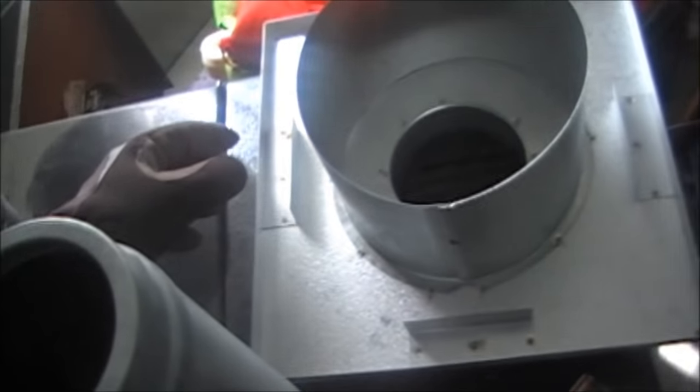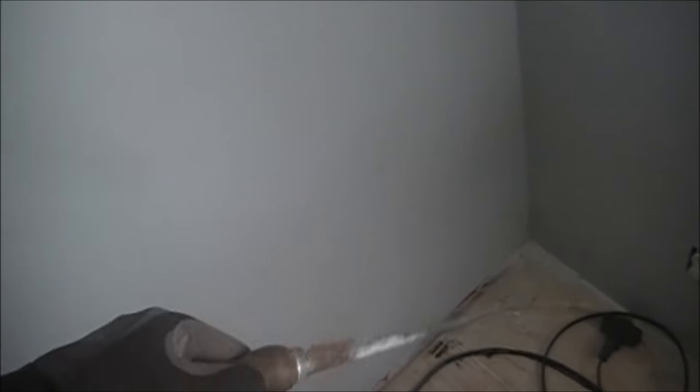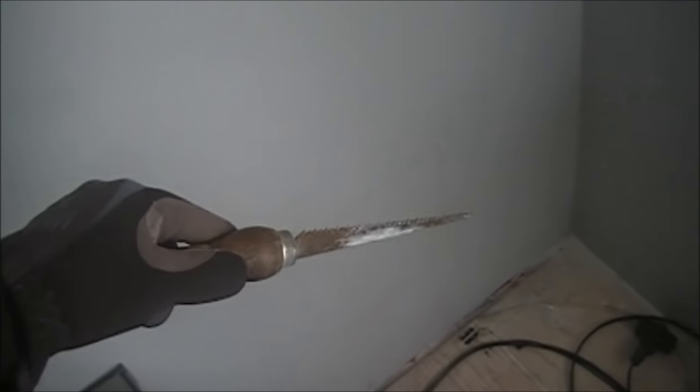On this plate there are little tabs here — that's where you had to measure around the outside, so that's 10 inches. So that's my next step. I'm going to use a drywall saw for the inside, and I'm not sure about the outside because it's aluminum siding, but we'll get to that shortly. So we'll get this cut out and take a look.